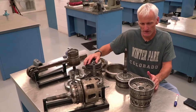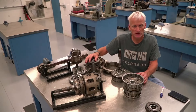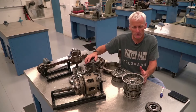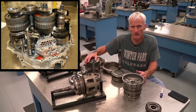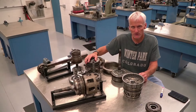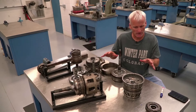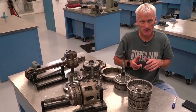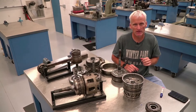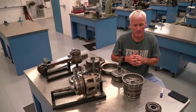The planetary gear is kind of the premise and basis of most automatic transmissions — though not every automatic transmission uses a planetary gear set. Honda, for example, previously just used helical-cut gears similar to a manual transmission and simply automated the shifting. We'll see Hondas at some point in this class. That's just an overview of a planetary gear set and how we utilize planetary gear sets in automatic transmissions. When we go through specific units we'll look more closely at how to inspect these planetary gear sets, but right now I'm giving you a basic rundown of things that exist in most all automatic transmissions.